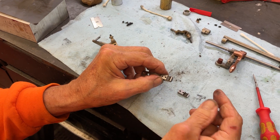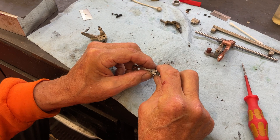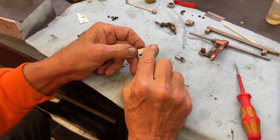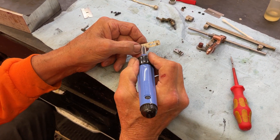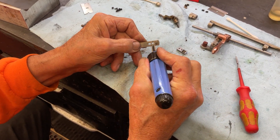The small end goes forward on an A1, so this is the small side and the thick side. We have to prep all this and you want to make sure there are no little burrs here, so you take a deburring tool like this one and you just come in and go around the edges.